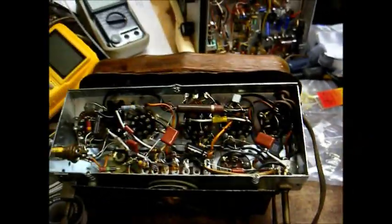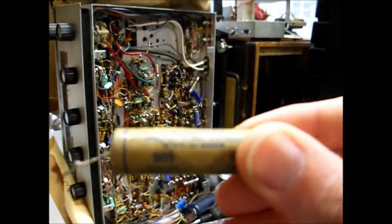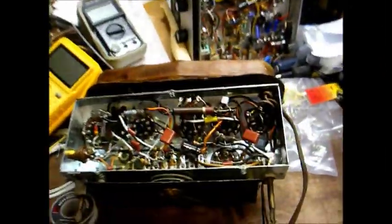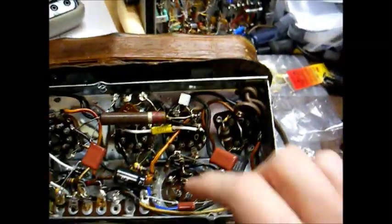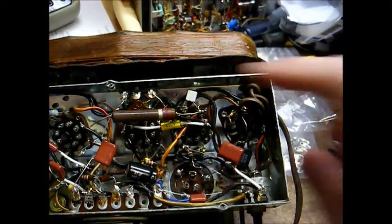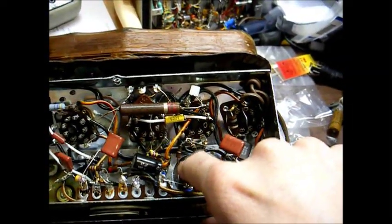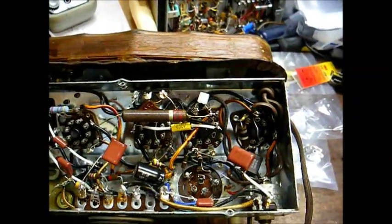Back on the GE, I've replaced all of the old paper capacitors, which all tested leaky. As far as quality, the solar-sealed type capacitors showed the least amount of leakage, but they still were leaky. Now we're replacing this electrolytic capacitor. I'm just going to leave the original can in place, disconnected, with modern single-section capacitors wired under the chassis. I've already replaced one of the sections. Before I replace the other two, we'll test these original capacitors just so I can show you the defect that they have — they all have high ESR.